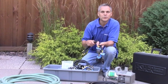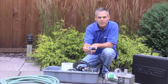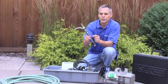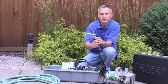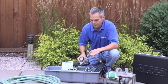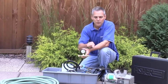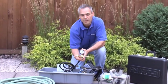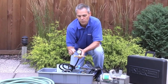These plugs would be used in easy-to-reach openings. Here's one with a quick connect fitting at a 90-degree angle that works real well for getting down inside a pump pot for testing the suction side. Here's a plug with an extension between the wing nut and the rubber — works great for putting pressure into skimmers if we're testing from the skimmer side back to the equipment. We'll take the appropriate plug, quick connect it to our pressure tester. Our pressure tester is a manifold that allows us to control either the water or the air that we're going to be using for the different steps of the pressure testing process.